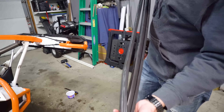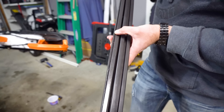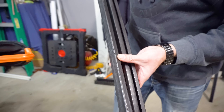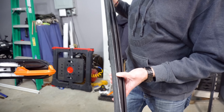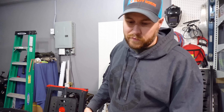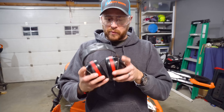The slides have wear guides on them, depending on who makes the slide. Some are more pronounced than others. The one closest to my body is the new one and the one away from me is the used one. As we get toward the middle where that first idler wheel is, you can see the wear line has all but disappeared — it's been completely worn off. It's also kind of scalloped, so it's got some pretty strange wear. Something could have got caught in there and dragged around by the wheels. If you flip it on the other side, you can see the wear bar is completely worn off through the middle.